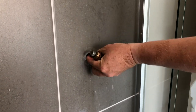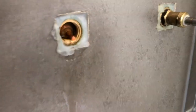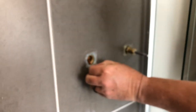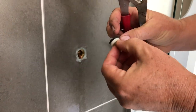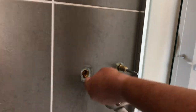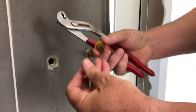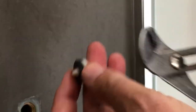That loosened it up - it was just because of that pressure. A bit of water will fall out, then we're going to pull this washer out. These slip joint pliers or just another pair of pliers - the washer won't come out easily. What happens normally is this style of washer has a rubber ring on the end and it gets squashed flat, that splays out and gets wider. We adjust these down, grab hold of that, pull it out - and sure enough, it's spread way out past the washer. It's supposed to be flat, so that washer is no good.